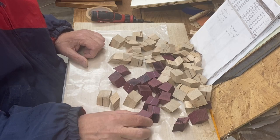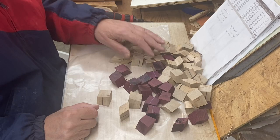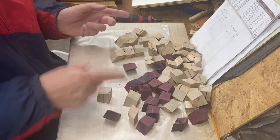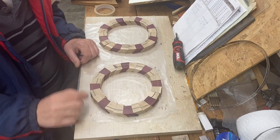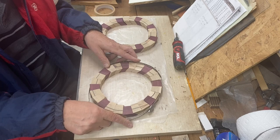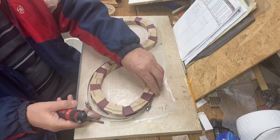I have 16 purple heart pieces, enough for two segmented rings, and more than 32 ambrosia maple pieces. You get one ring slanting this way and the other ring slanting the other way, so I've got to sort through and pick the ones that go in the right ring. After eliminating the pieces I didn't want, the next thing is to check the fit. Another nuance of cutting on an angle is that as you tighten the ring up, the pieces want to pop up because they're on angles, so you have to put a disc on top.